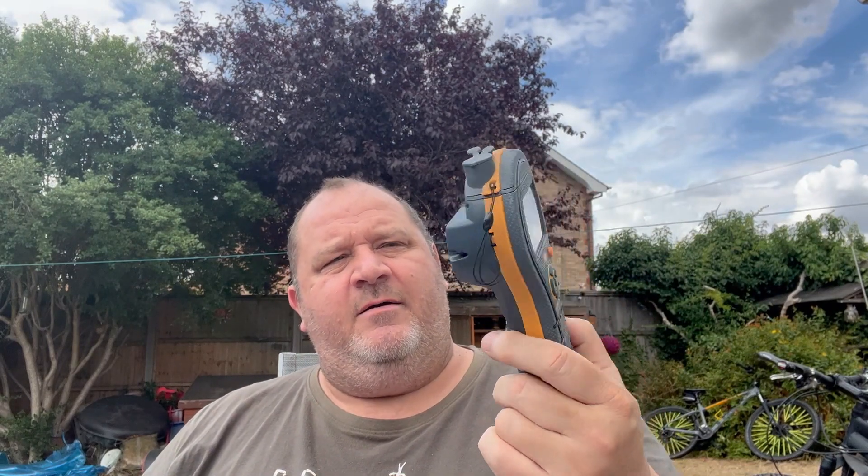So this is really good if you've got a floor layer who's just laid a concrete floor and you want to know that the moisture content has gone down enough so you can lay a non-breathable vinyl flooring. If the floor is still too wet, moisture has got to escape somewhere — it can't escape through a non-breathable vinyl floor, so it'll come out the sides and make the walls wet, creating damp problems.